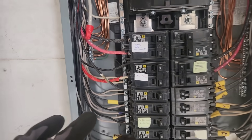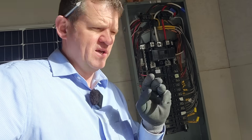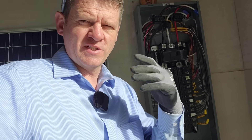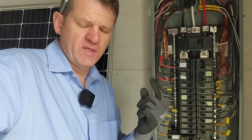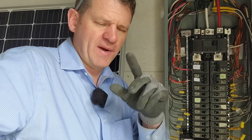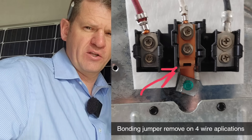I did that for all of my circuits in my house and I was able to find three circuits that had a really solid ground neutral bond. Some other circuits did show continuity but the resistance was really high — one of those I think was an electric vacuum plugged into the outlet, which was actually measuring some inductance. So I did find three good connections — those are the ones I wanted to fix. The first circuit was actually an electric dryer. The dryer plug was wired up kind of weird where my ground and neutral were connected. I fixed that wiring and it cleared out that one.